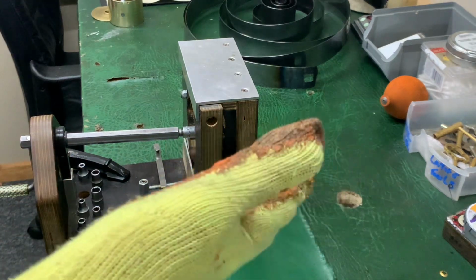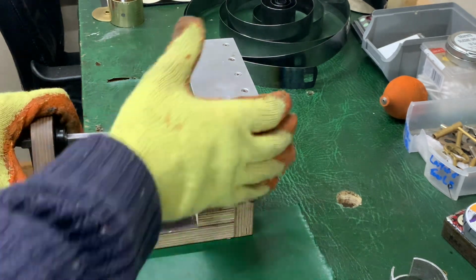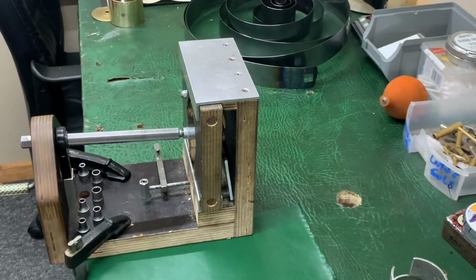I wear gloves when I'm dealing with this. These are a little bit heavier because it's a fusee, just in case something happens, because we've had the arbor break in the past as we've been winding the spring in. So we try to be as cautious as possible. I wear glasses with plastic lenses to protect my eyes, but I would say really wear some kind of eye protection, especially when you're just starting to do this, because they're pretty lethal, them springs.